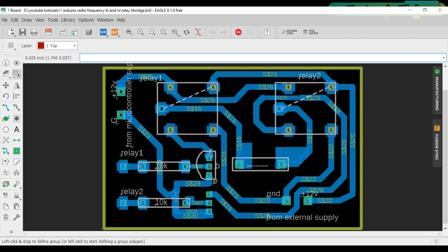Also watch a tutorial on PCB design transferring and etching. As per the circuit diagram, we connect the 12V and ground wires from the external power supply here. A DC motor is connected via the common pins of the relays. The normally closed and normally open contacts of the relays are connected with the external power supply. These are 2N2222 NPN transistors and 10k resistors. Let's use these same components — 2N2222 NPN transistors, 10k resistors, and relays — to make an H-bridge module.